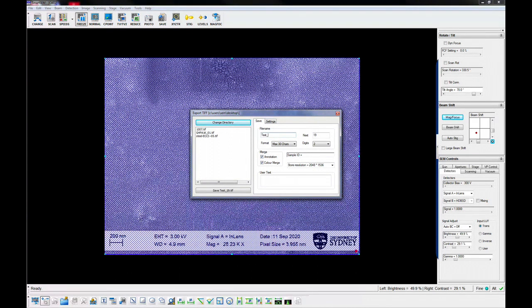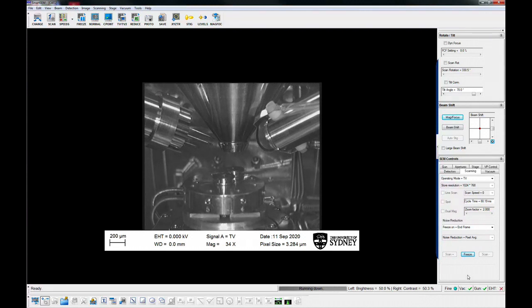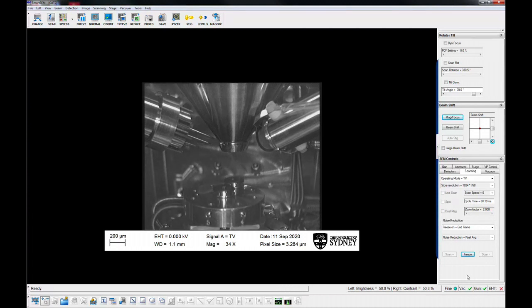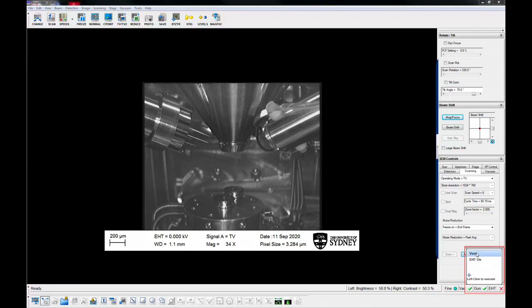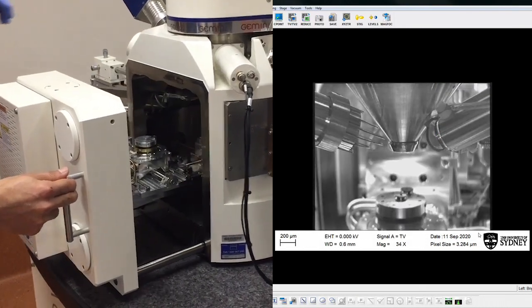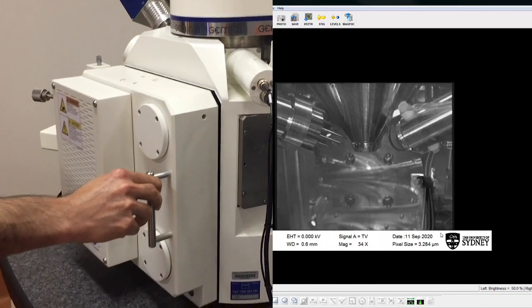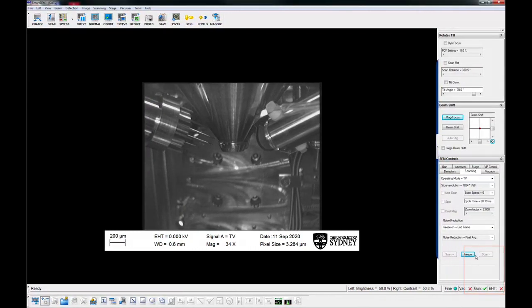At the end of your session, go to TV mode. Turn off the EHT. If performing EDS, EBSD, STEM or backscatter, then retract these devices. Lower the stage to a safe position, approximately mid-screen in TV mode. Return the stage to 0 degrees tilt if required. Vent the chamber. With a gloved hand, remove the specimen holder, then close and pump the chamber. With your ungloved hand, select Vac Pump. Carefully unscrew and remove samples from the sample holder and put it back in the desiccator. Make sure the vacuum status is pumping before you leave the instrument.